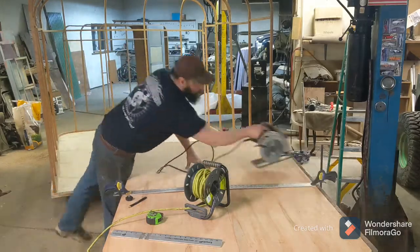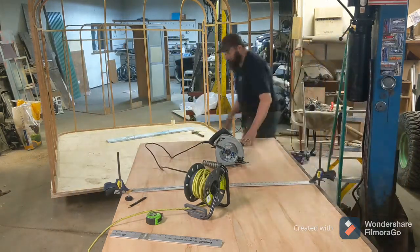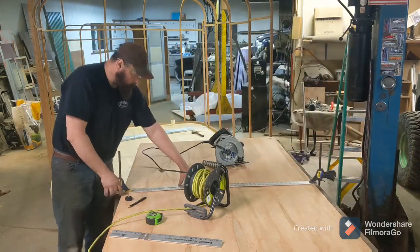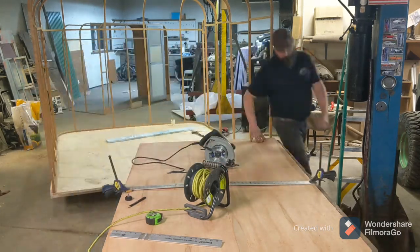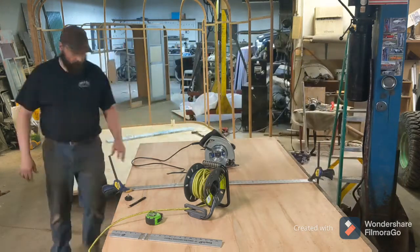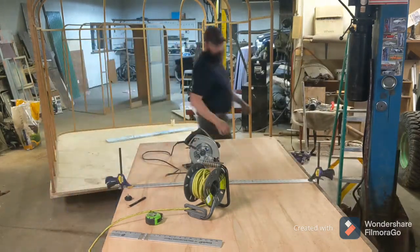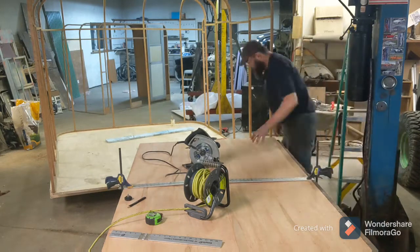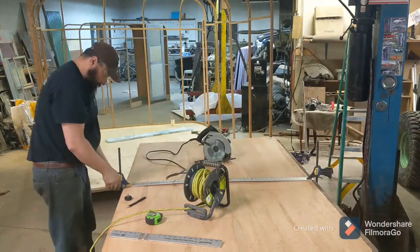As I was editing the videos this week, I found that it's really pretty boring — all I'm doing is cutting kerfing. If you don't know what kerfing is, it's just cutting a little over halfway through the board to give it a little more flexibility. I put about 15 or so kerfs for each piece, then glue it and brad nail it to the frame. It's all just repetitive.